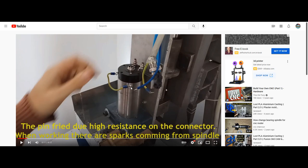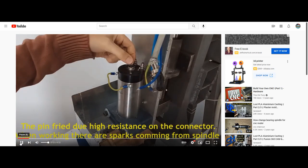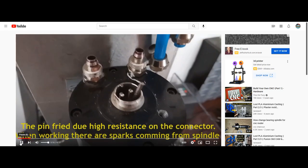God knows how deep this is. And of course, he is using crimp connectors. You know how I feel about crimp connectors. Solder everything. Solder these crimp connectors. You have no idea if these are making full continuity as they should. I have seen so many crimp connectors fail, and the resistance is much higher with crimp connectors. And it's funny, he brings up high resistance here, and yet he's crimping. So again, I don't know. But let's go into more detail with what we see going on here. Once again, I'll let you guys decide.